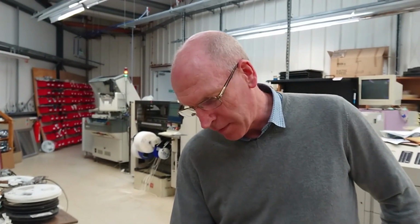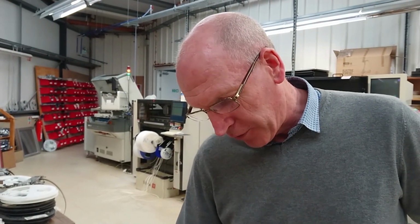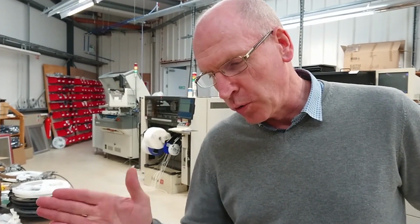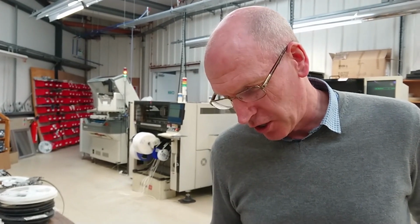And what ends up happening is you have a very noisy power supply. And then this affects the RF of the amplifier. And suddenly it will start to develop oscillation-like tones coming out of the front end. These will go up to the base station, and they'll wipe out a base station so that the base station can no longer service users. So the operators are obviously immediately notified automatically by the base station that this has occurred.